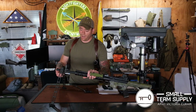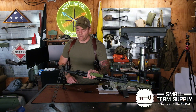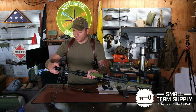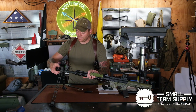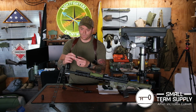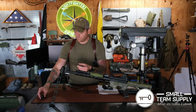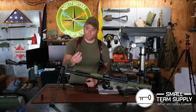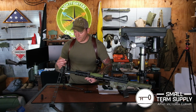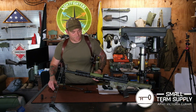It's pretty simple. First things first, get your 19 wrench and loosen your muzzle adapter, and go ahead and screw that off. Make sure you don't lose any of that stuff right here. You've got 2 little buffers: your little washer for your flash hider, and then another piece right here that has a little divot and orients upwards when everything's installed. So just set these 2 pieces aside.